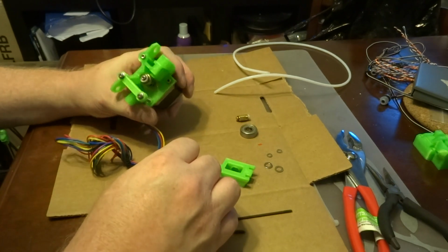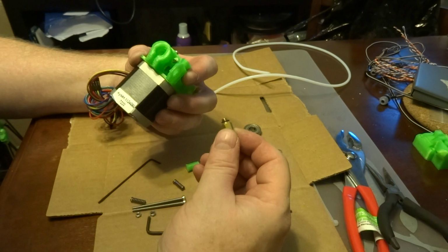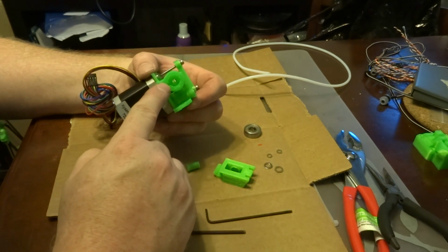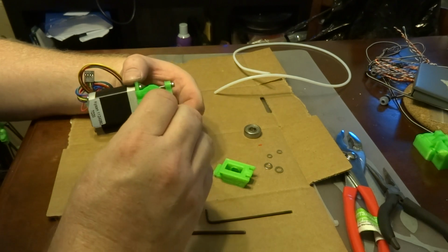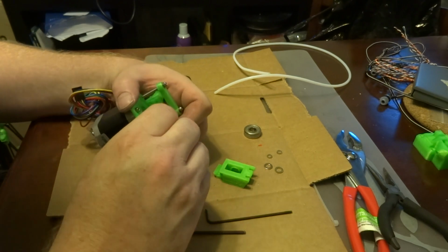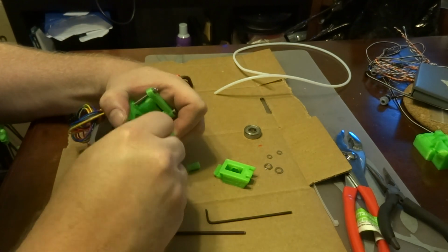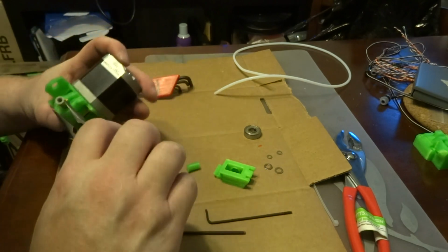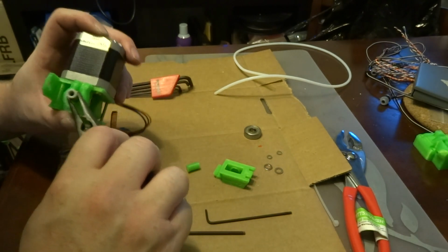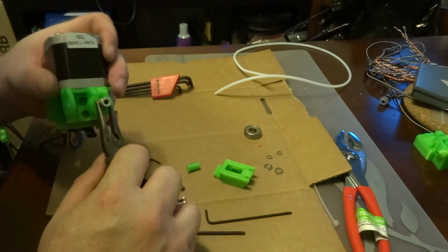Okay, so now our body is assembled. The last thing that we want to do is attach the push fit. Now this has been pre-tapped for you. This is an M5 tap, just like at the top of the effector. So we'll put this in, and we can turn it by hand. If it doesn't grab, you can grab a little bit of glue and dab the sides, but don't tighten it down too much. You only need it a little bit.